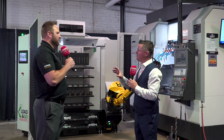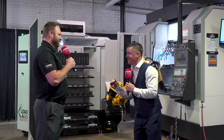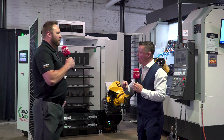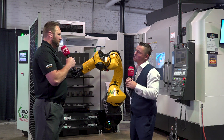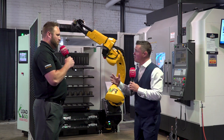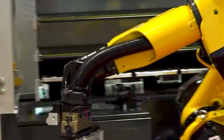I want to take this a little bit from the expert level down to a beginner level. At the bottom here, I have jaws going in and out of the machine — I can literally switch jobs on the go as it's working. The second tier looks like some rectangle blocks, the third tier looks like some round bar, and then I see rectangle again. We are going from job to job, part to part. It's not a universal rectangle — I can switch out any rectangle part I want. I can plug it in on the side of the machine or on my computer and say, this is what I need to do next. It truly is for that high mix, low volume job shop.